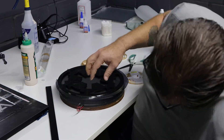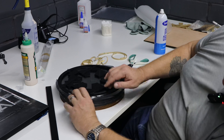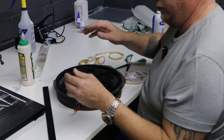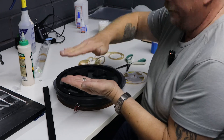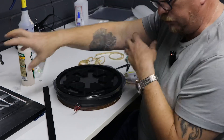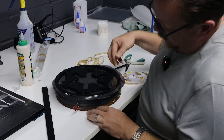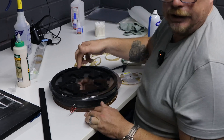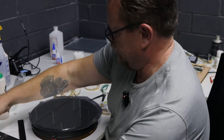We'll trim everything. It's pretty thick — I don't think it had to be that thick. If I were to do it again, I'd probably take out a couple of layers that are not completely necessary. But the higher the distance between the bottom mirror and the top mirror, the deeper the infinity effect is going to be. So that's pretty much it. I'm going to trim the mirror, solder the LEDs, put it all back together, and show you what the final product looks like.